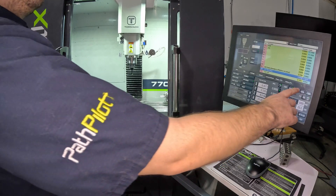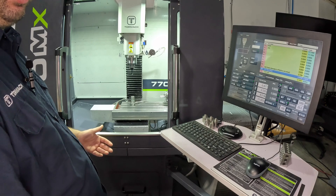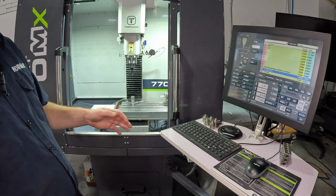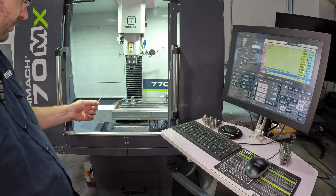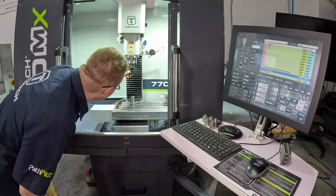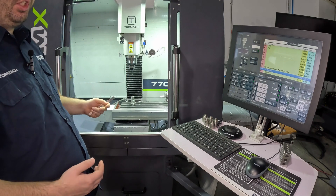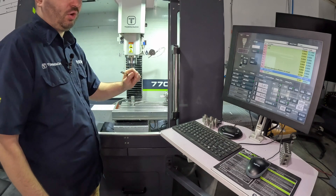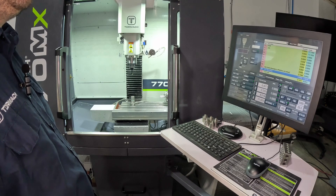Our tool length has now populated with a value of 3.351 inches. If you're ever not sure if you have the right offset or didn't complete all the steps of the setup, you can always verify the numbers an ETS gives you by having a scale, ruler, or tape measure and holding it up to the spindle. This is a little over 3.25 inches, so that's just right. On Tormach machines, all tool lengths are always positive from the face of the spindle, so whatever value you have for this length is always what you're going to see in the tool table. That's a quick sanity check to make sure everything is how it should be.